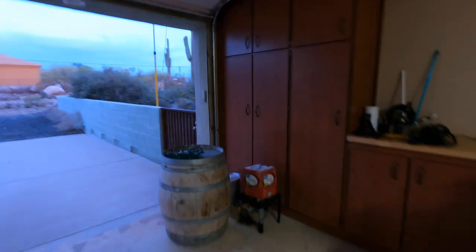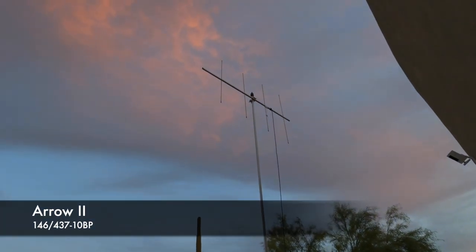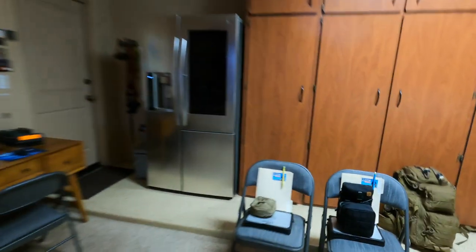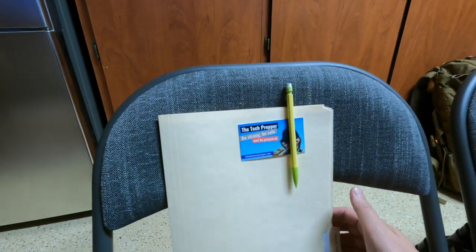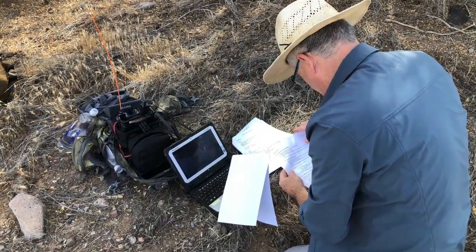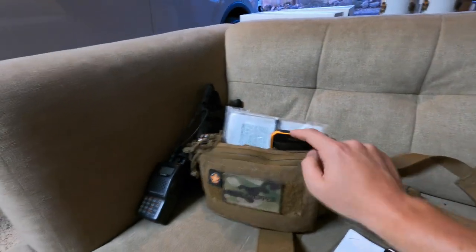That's pretty much it for net control. In terms of antenna, we've got a little modest two meter Yagi antenna up about 16 feet. Right now it's pointed south so I can listen to traffic as people approach the house, but we're going to flip that around at the National Forest when we start the exercise. For the other stations, I've also prepared welcome packets for the guys here by their call sign. The Tonto station is going to have the FT-60R HT with the Toughbook. Mobile One will have my 8800 man pack with the Toughbook. My station is pretty modest — just an Android phone with my FT-60R, and I'm primarily going to be doing acoustic coupling.